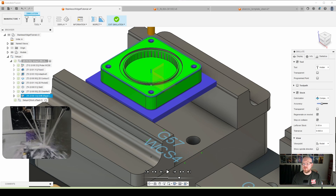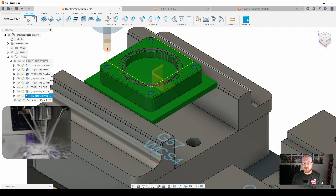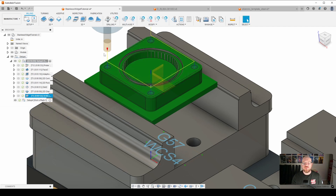I do spot drill harder materials, though it can be annoying — I have a 12-tool umbrella, so that extra spot drill position can be a limitation. Back when I had the Tormach 770 without a tool changer, you learn quickly how fast you can fill 12 positions. Only having 12 positions means occasionally you have to rough and finish with the same tool.